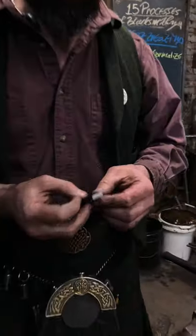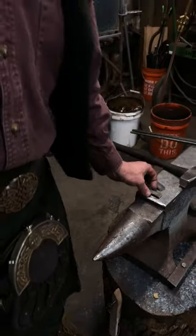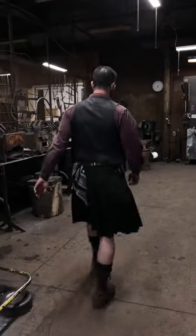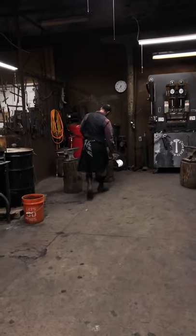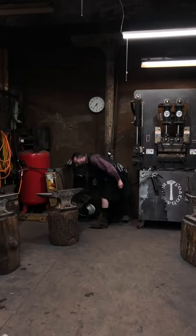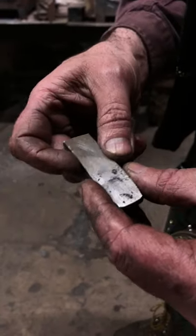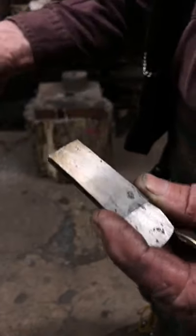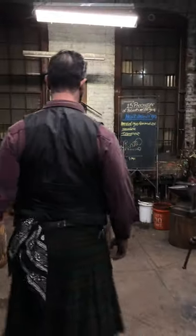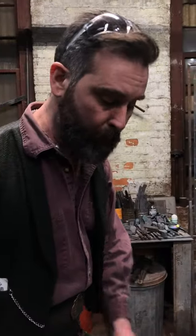Finally got that to fail in the blue zone here, and again very, very fine grain structure. So just from that, I'll gather up the pieces to talk, but hopefully when we go back and look at the video, you'll see how much effort each piece took to get to fail. So that silver portion here failed pretty easily. This one was a little bit more tough, and then into the blue was really quite tough. So hopefully that helps explain a little bit about your hardness variances and your toughness trade-off with the temper cycles.